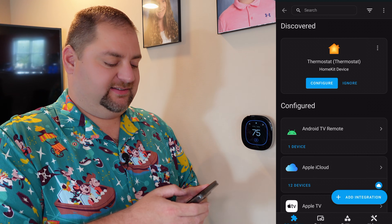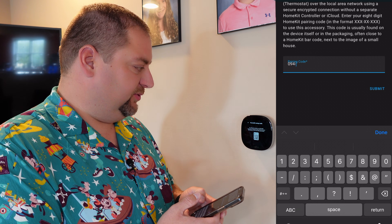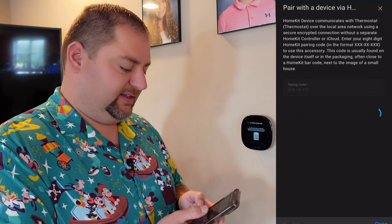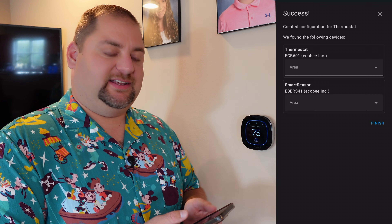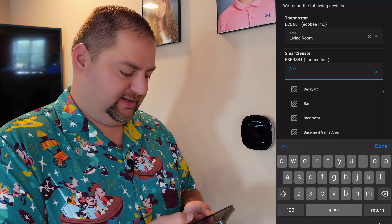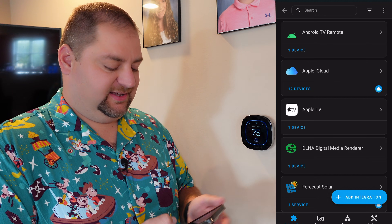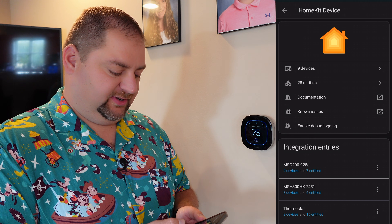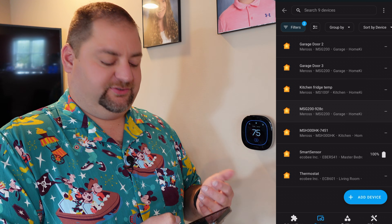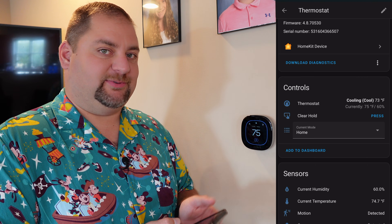Back in Home Assistant integrations, immediately like usual it's discovered. It's saying it's a HomeKit device and it's a thermostat. So I can go ahead and configure that and use the pairing code it puts on the screen. Just make sure you follow the Home Assistant procedures — it tells you how to put those dashes in: three digits, a dash, two digits, a dash, and then the last three digits, then submit. If you don't put that in right, it won't show properly. So I can go in and tell it that this is in our living room and that the smart sensor is in the master bedroom. And then I can finish. Just like that, it added the other devices. Going down into the HomeKit devices, we find the thermostat and the smart sensor. It shows right away the Ecobee tells you the battery life of the smart sensor. Let's go in and see what we can configure in the Home Assistant app through the HomeKit integration.